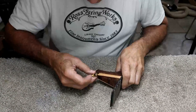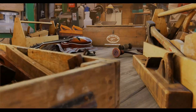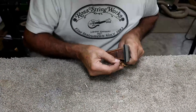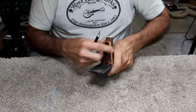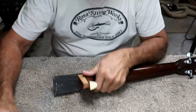I've got my little bitty 8mm finger plane, which I sharpened yesterday and it's crazy sharp. I'm just trimming off any little excess that I don't want in my way. I try to make everything a little large and you can always trim it down. These shims are pretty close to fitting but they needed just a tiny bit of trimming. I have to get up there and trim the end because I can't get the finger plane all the way up to the end. The end here is a little long, and I just want to make sure they're not going to be a problem getting down in the joint. So that's trimmed sufficiently.